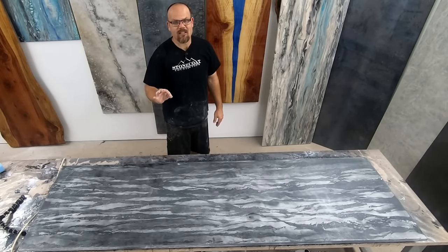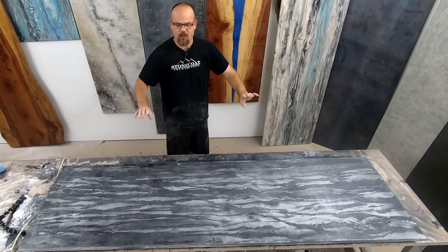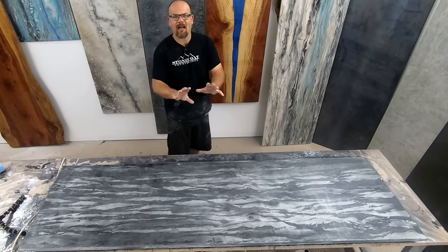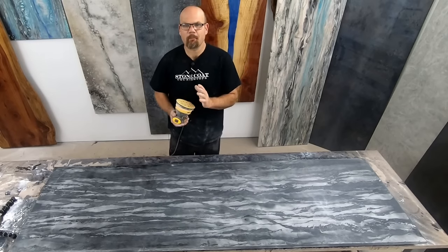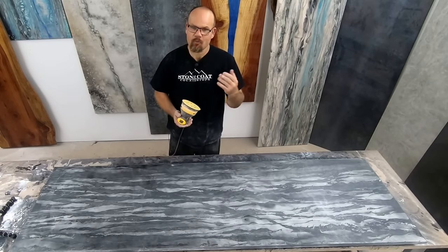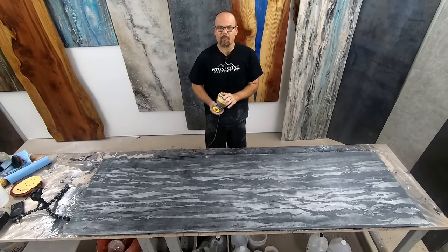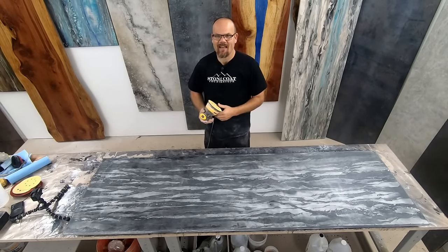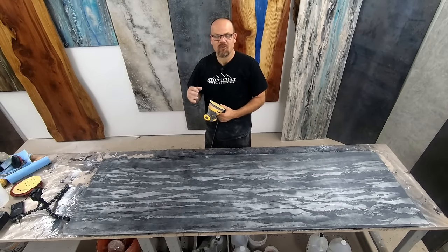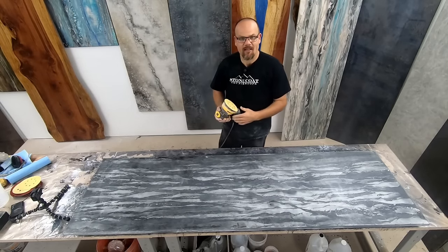That's the key — you don't have to get it perfect, but make sure you feel it because when you get the polish back, that's what you're going to feel. Some imperfections in the sheen won't show through, but how it feels is important. That first grit is really important because that's where you're removing all your imperfections; from that point on, you're simply bringing the shine back, so it's not as long between grits. We also highly recommend practicing on a sample board first before you get the hang of it — that way you'll know what to expect and you'll have something to show your customers of what the sanding and polishing end result will look like.